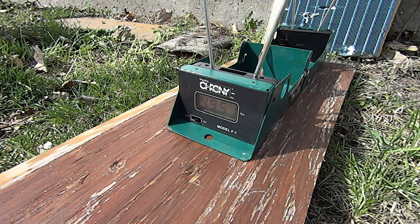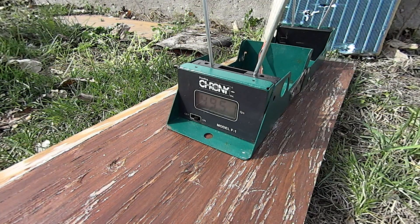Alright, so there you have it for the time being. I'm going to go fill this thing back up to a little over 300 and we'll take a couple more shots and just see what we can get out of it. Gun's back up to just over 300 — I think it's about 310. I think this thing could handle a lot higher psi. The issue is that the slide valve gets really hard to press when it gets over 300, so I'll have to figure something out for that — probably add a lever to give it a little more mechanical advantage. But anyway, we're up to about 310, so we'll take one or two more shots here and just see what our average is.